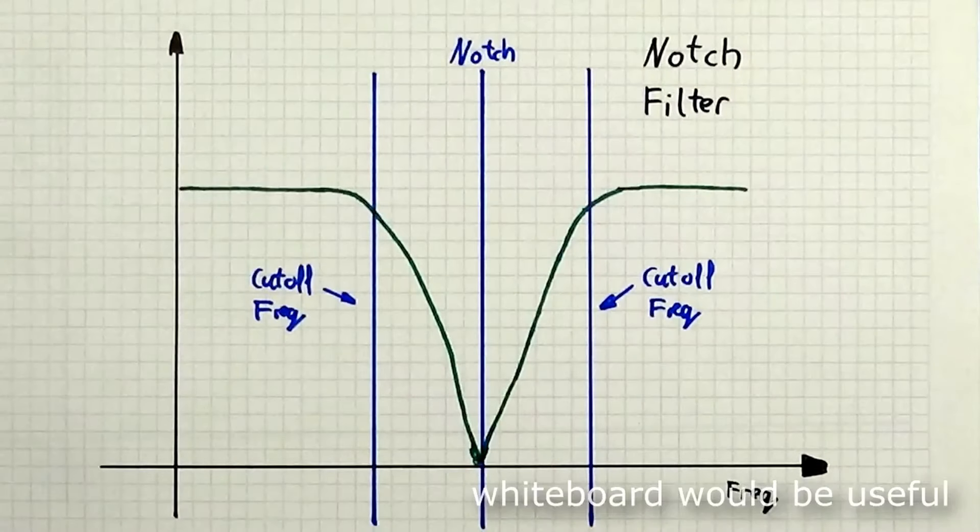Setting up a low pass filter is quite simple — we only need to know the frequency of our main noise source. For example, mini quad motors generally generate frequencies above 150 Hz, usually more. So if we set a cutoff frequency at, say, 90 Hz, the signal coming from the low pass filter should be pretty decent — not perfect, but usable. Not long ago we were not using notch filters at all. Notch filters are slightly different — they are not designed to attenuate everything above a cutoff frequency, but rather to attenuate a specific frequency range, attacking only a given spike in the signal spectrum.